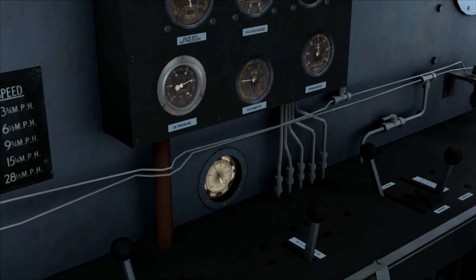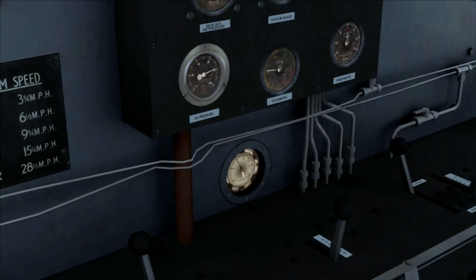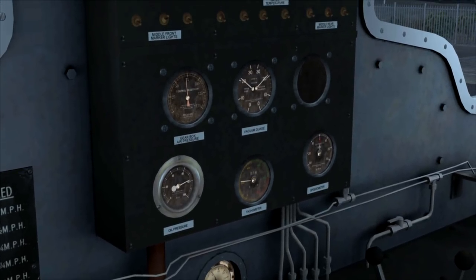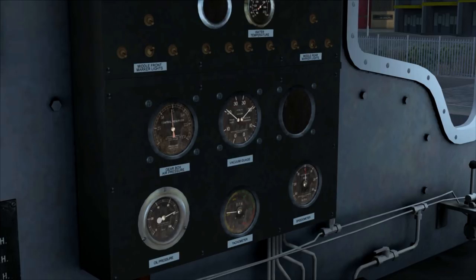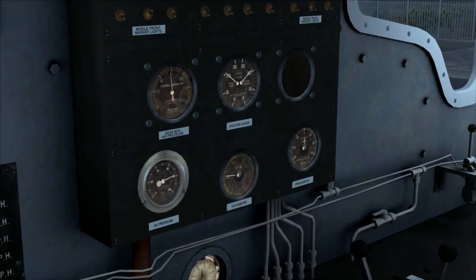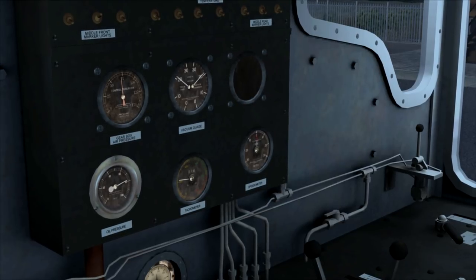In the middle of the cab at the bottom we have the fuel tank gauge, measured in gallons, showing how much fuel is in the tank. Up here we have several gauges — most work, but some aren't really important for driving. We have oil pressure and gearbox air pressure. In the middle at the top is the vacuum brake gauge, showing how hard the brakes are applied. Below that is the tachometer, showing engine revs, which is useful when changing gear. To the far right, though quite difficult to see, we have the speedometer, which can read forward or backwards to show which direction you are travelling.